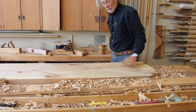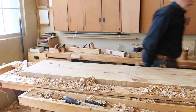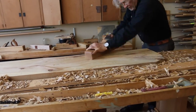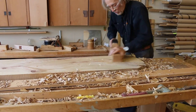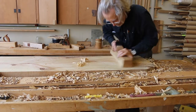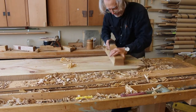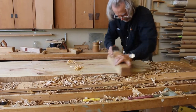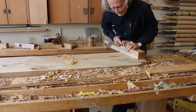But generally, the joiner plane is a transition into working with the grain, and the planes after that will be worked with the grain. And you see we're having, so far, pretty good success not having heavy duty tear out and eliminating the tear out caused by the scrub and the jack plane.